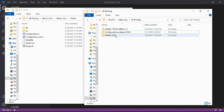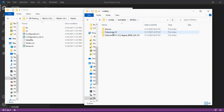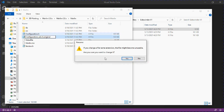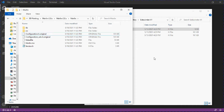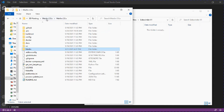What we have to do is go into the configurations, into the config examples, and find the brand and model of our printer — so we go into Artillery, then Sidewinder X1. Here you have three configuration files. Rather than just dragging them over and destroying the originals, I like to rename the originals to 'original' as a backup. Then I take those three files and copy them over to the Marlin folder.